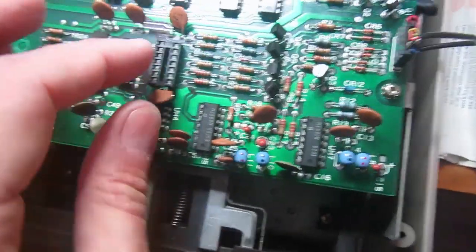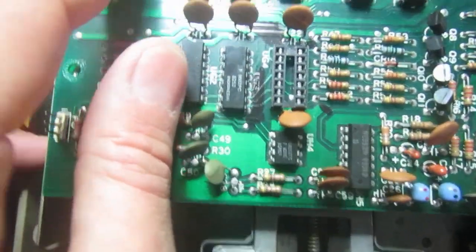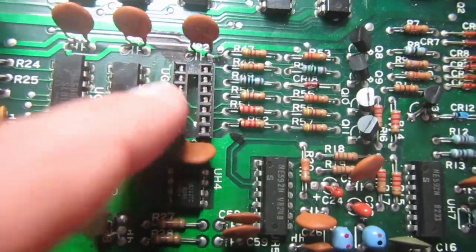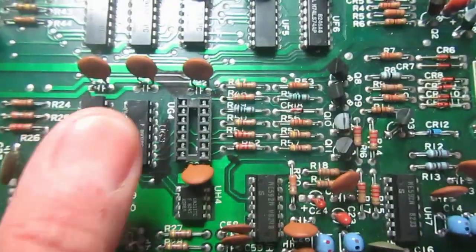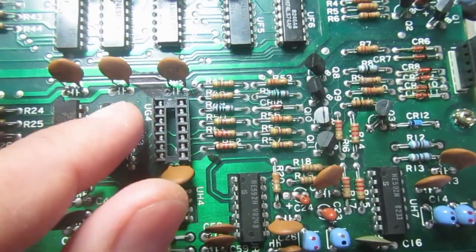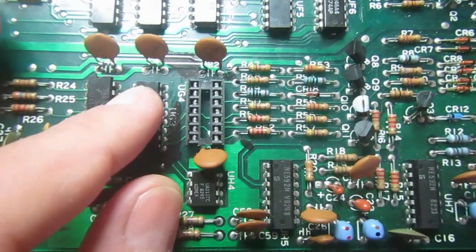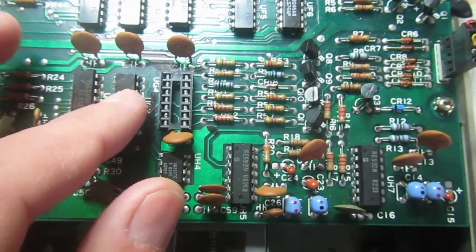So in the end, here we had a bad chip that was causing most of the faults. But I don't know if the broken diodes, or the interrupted one we have found at the beginning, were related with this. I don't know. The circuit is close enough, but I cannot tell that. So an LS07 is a perfect substitution for a 7407, but beware of the fake chips. Always double check when you buy vintage chips in modern times.